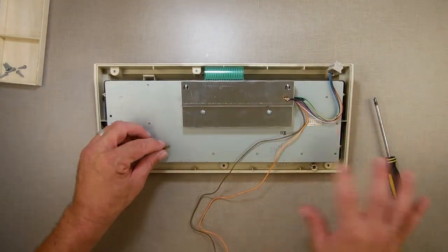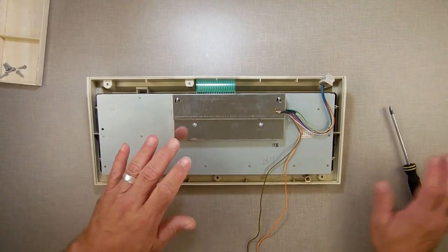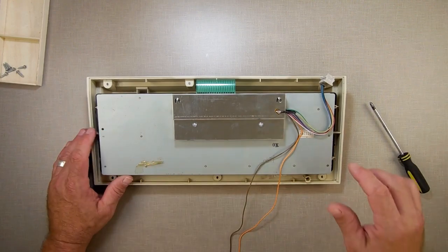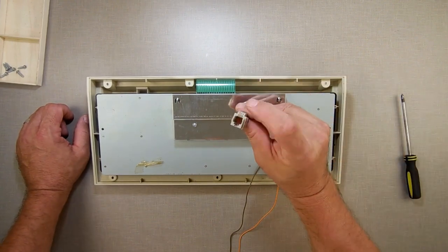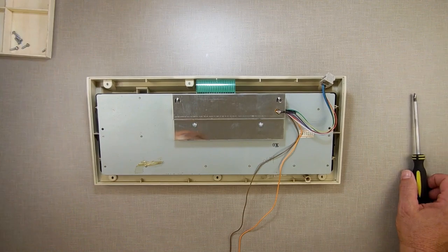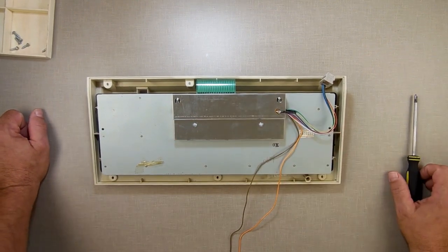I'll show you what. Let me finish my little story here. All right, the 6801 microprocessor that's in here is scanning the keyboard, and it stores up to 14 key presses in registers or memory or whatever. And then, when it picks up a message going through the AtomNet, which plugs in here, saying device 15, what's your status, what do you have? It'll send back the key.